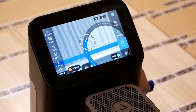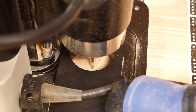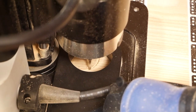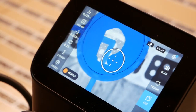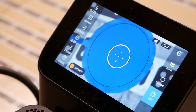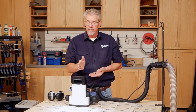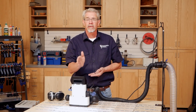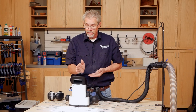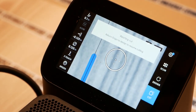The Shaper Origin really worked well when I was cutting out the circles in the Nine Men Morris game. I first cut the outside of the circle with an eighth-inch diameter bit, and then I used the pocketing option to remove the rest of the material. As you can see, I am driving the Shaper, but the machine makes micro adjustments to the router bit to keep it perfectly aligned with the program. Should I drive off the road, the router bit will lift to keep me from ruining my work piece.